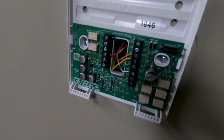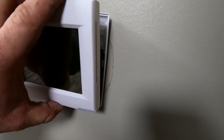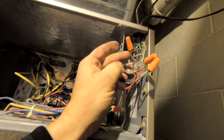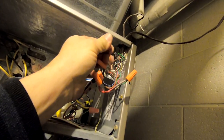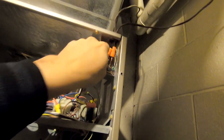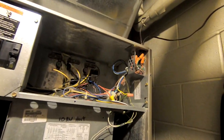We're back to the heat pump with the bad board and bad thermostat. We've got the new Honeywell thermostat installed with O, Y, G, auxiliary, R, and common wired up. We've already gone through and set the thermostat up. R for the thermostat and the outdoor unit are connected together. Common for the outdoor unit and thermostat is on brown. Auxiliary heat from thermostat and outdoor unit is connected. O is the reversing valve from thermostat to outdoor unit. G is to the indoor fan for calls for heat or cool. Pretty elementary, but pointing it out since most of these videos are aimed at new guys.